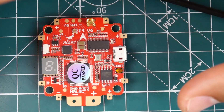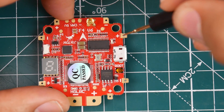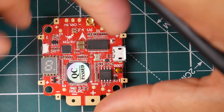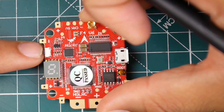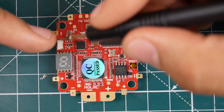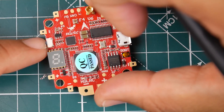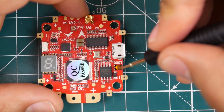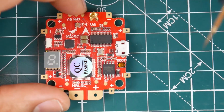Let's look at the board. We went over the layout — it's correct. The pads are pretty small for the ESC power, which I don't really like, but overall it should do the job. The amount of filtration is very minimal — I don't like seeing that. Be very careful with this button; you could easily pop it off. If you do, just short out the pads underneath — that's all clicking the button does. We do have an OSD chip, which is nice — Betaflight OSD. We have a boot button, and this is supposed to change channels for the built-in VTX, with an LED display to tell you what channel you're on.